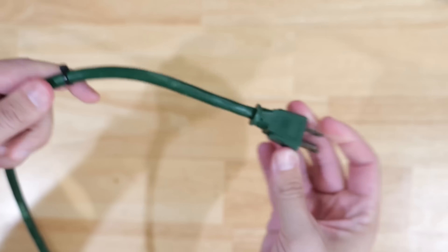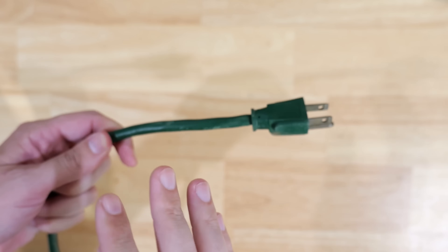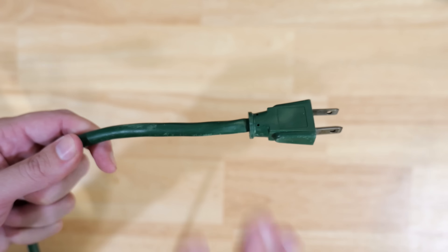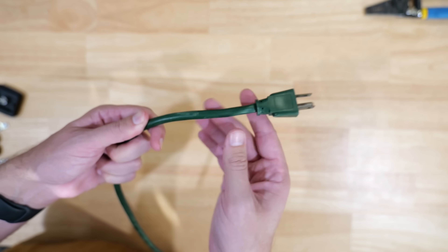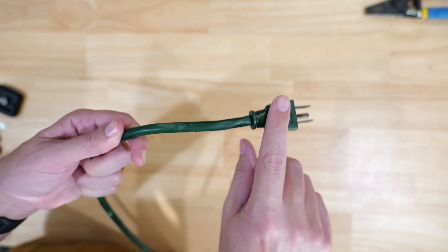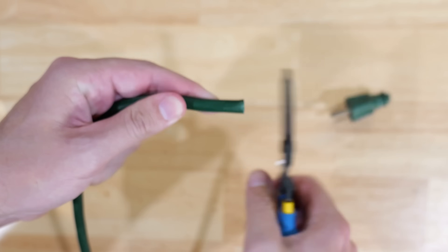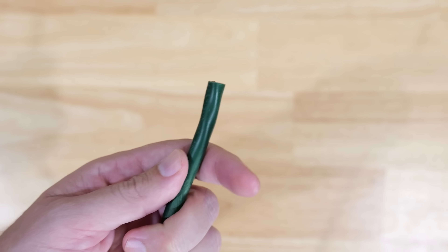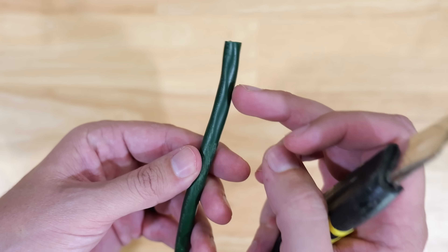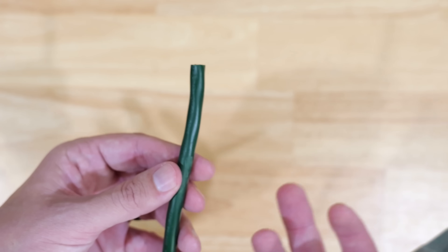Here is your standard extension cord — they come in a bunch of different shapes and sizes. It can be an appliance cord; it doesn't matter. Any cord you're wanting to get GFCI protection for, this is going to work. In this case I don't have a damaged cord on this end, so in order to make this work you need to cut off the male end. You can do that easily using wire strippers in the cutting section and just cut it off. Then we'll need to remove some of the sheathing from the cable to expose the wires inside. We don't want to take off too much because we don't want any exposed wires coming out of the bottom of our GFCI plug.